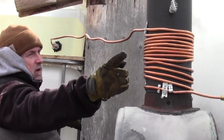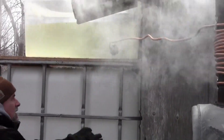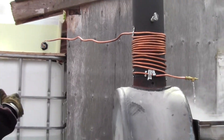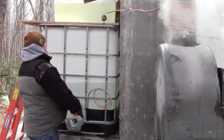And I ran it all the way around, brought it over here to what's called a bulkhead fitting, and it goes into this — just a cheap little tote that you can pick up, a storage tote. You can pick them up at Walmart or anywhere like that. I connected the tube to it, and with just enough gravity feed, it feeds into this, goes in through my worm coil, and then comes out into the back of my boiling pan. This holds about 20 gallons, so it works really well.